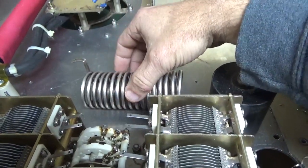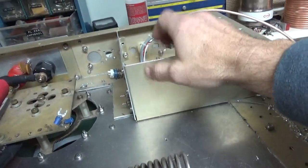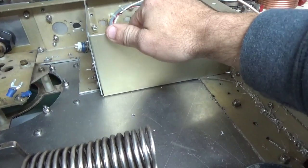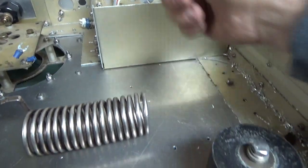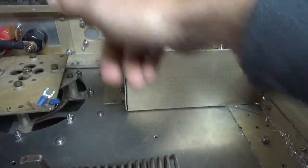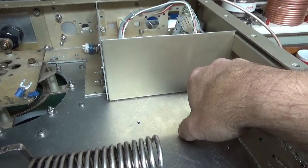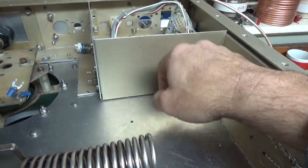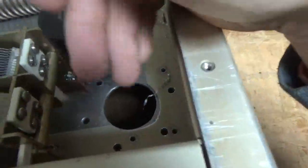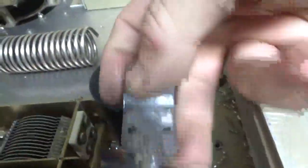Next step will be the biasing diodes, and I'll mount the protection board and go from there. A piece of RG-400 will come off the RJ-1A, go out to the parallel, come through the RF deck and go to the paralleled RJ-2Bs for the output switching — all Jennings. I'll mount the vacuum variable caps for the output network. I already have the holes pre-drilled, and then I'll take the right-angle drives like this one right here, measure everything up, go through the front panel.